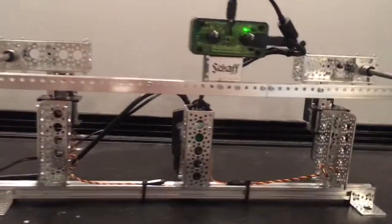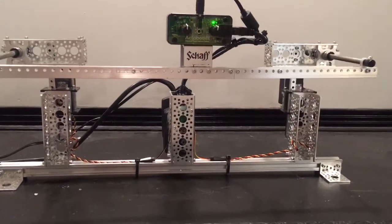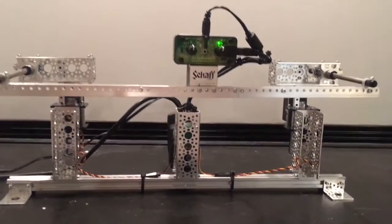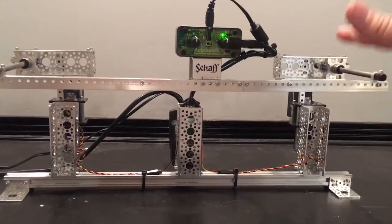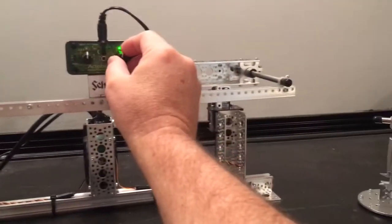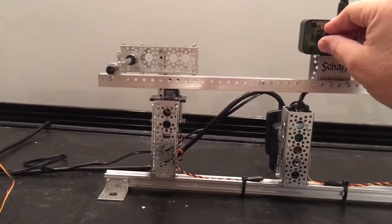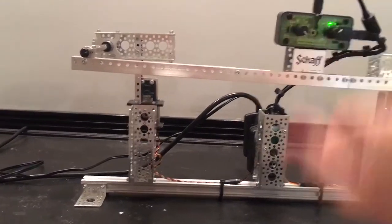One thing is that I used to do a ton of regulation, and I remember that I would always smack the let-off rack with my capstan wrench, because I was always moving it up or down a tiny bit. But now I don't have to do that at all, because like I said, I can just move this anywhere I want, and I just have such perfect control of it.